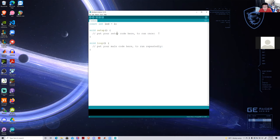Stage two of the Arduino code is the setup function. Here you want to instantiate your serial monitor and use pinMode to declare if your pin is an output or input. Your Arduino needs to know if it's going to send out signals or receive signals. So I'll do Serial.begin(9600) and then pinMode(led, OUTPUT). When it has a digital logic of one, it's going to send five volts out the pin.